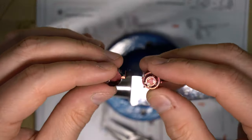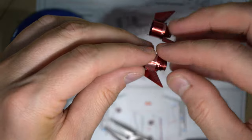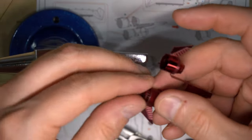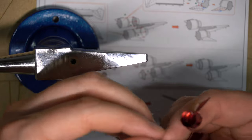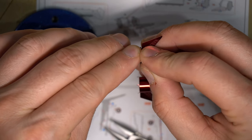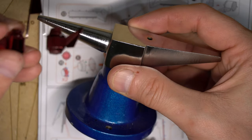The tabs are folded back but they're not flat. To get them nice and flat, I'll use a jeweler's anvil — I can take the piece to the jeweler's anvil and simply press them down. I could have done this on the jeweler's block, the hunk of steel to my right. But I like the anvil because it gives me a small surface to work on rather than a really large surface. Flattening out those tabs is done very easily on the jeweler's anvil, and it has many other purposes as well.